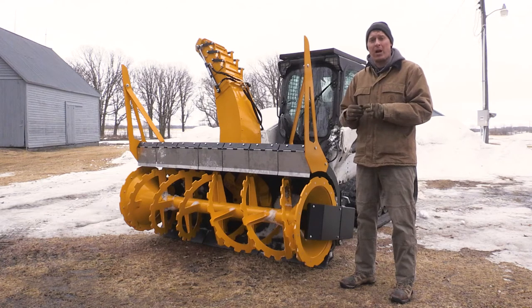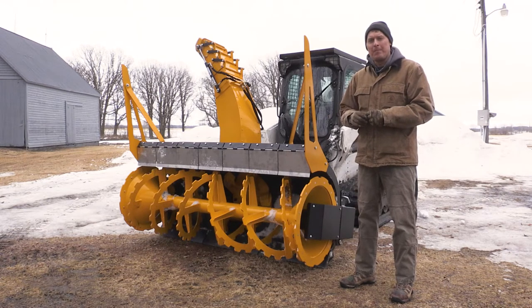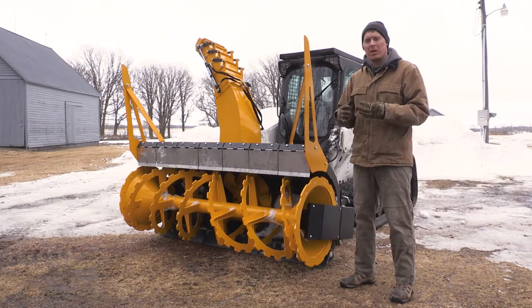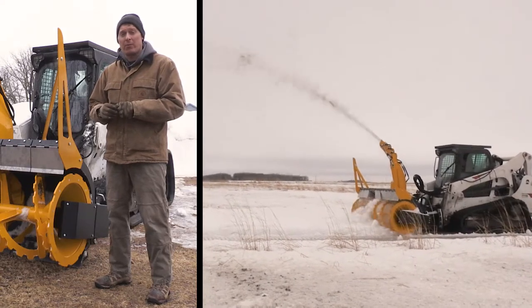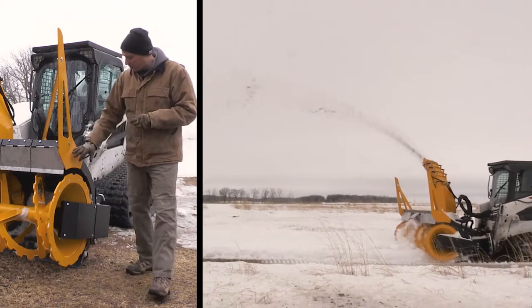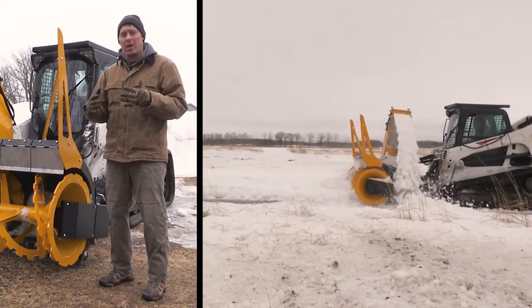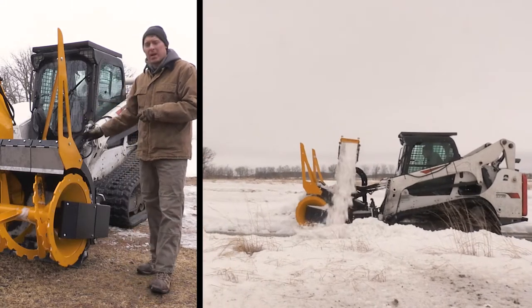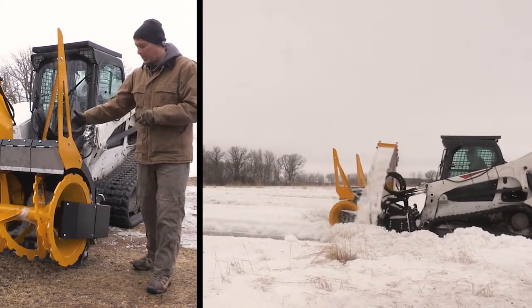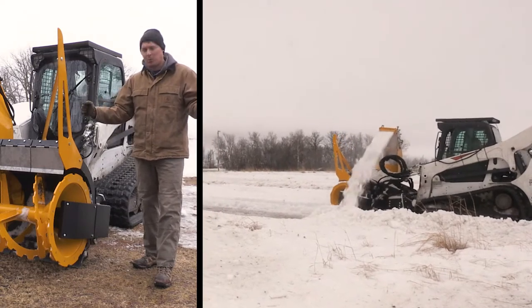This type of snowblower is meant for high-flow skid steer loaders and also small to medium-sized wheel loaders. When you look at this snowblower you can see that the frame design and structure is quite different from a typical snowblower, because of the amount and conditions of snow it's typically used in. You'll usually find it being used in the mountains or areas with high snowfall totals. The end plates are basically open, which allows it to cut through heavy snow better and drag in snow that may fall in. The back of the blower body is heavily reinforced with plate steel, and it has reinforcing tubes that run from the mounting plate up to the front corners to support each side of the blower body and keep it stiff.